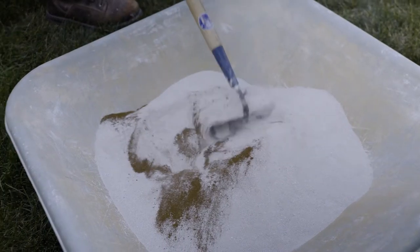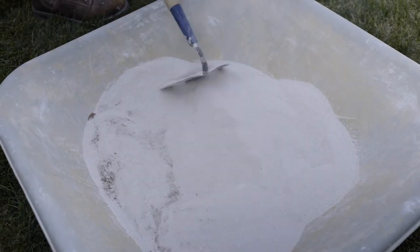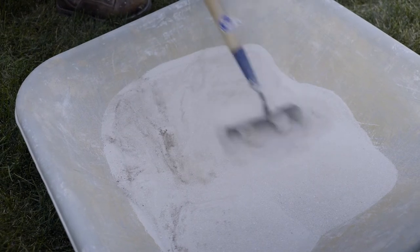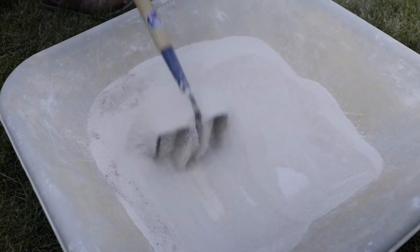It's important when you're adding pigment to pre-blend the pigment well with the dry mortar and the dry sand first before adding water. Otherwise you can get clumps of sand or clumps of lime, and the pigment won't disperse evenly — so when you're pointing your wall you might get pigment streaks in the joints.